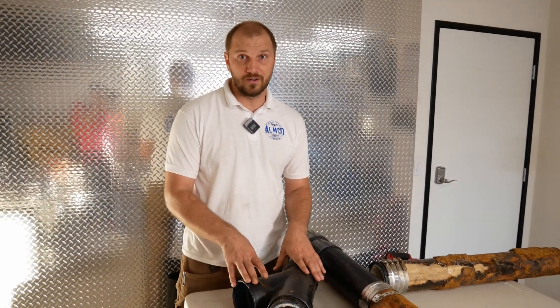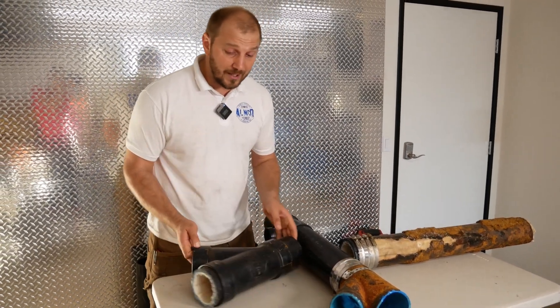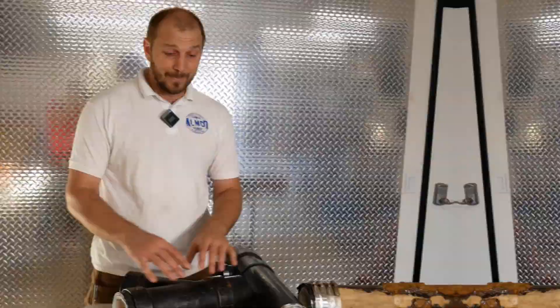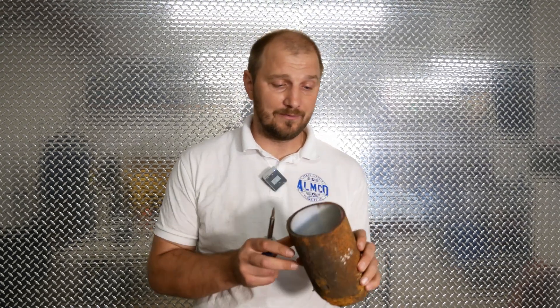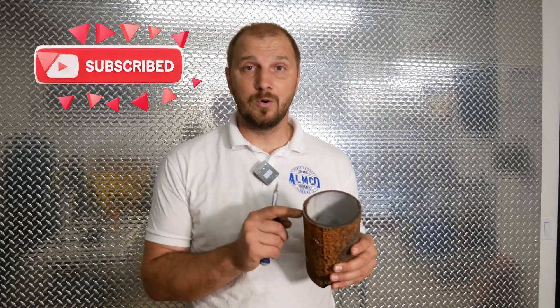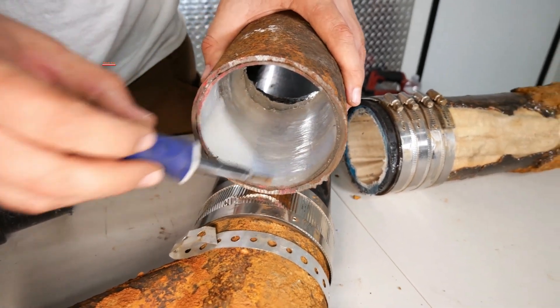Roots growing here will eventually require jackhammering and digging to repair the fittings because they will fail or collapse over the years. They give you a warranty for the liner work, but where we haven't epoxy-lined a section, we don't provide warranty. If something happens there, it's your responsibility. Water is still present and will corrode the pipe. With pull-in-place, water still travels between the liner and the pipe — there's always a gap. Here I have an example pipe and I'll show you what happens.